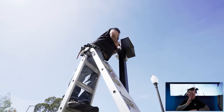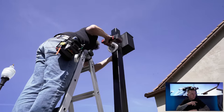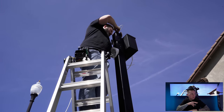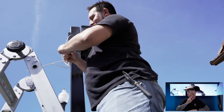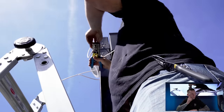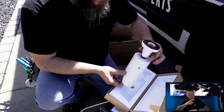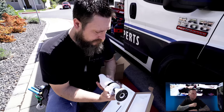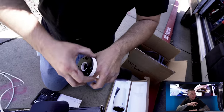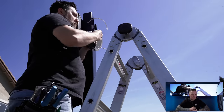The pole sits on the corner of the community entrance and houses five cameras: two license plate readers, two viewing cameras, and one fisheye camera for a full wide view. An electrician brought power into our junction box, and inside that box we also have a CradlePoint, which gives the cameras internet. That's how you can remotely access these cameras without any other internet provider or router on site.